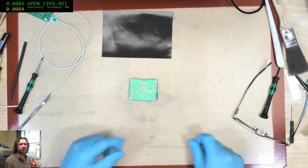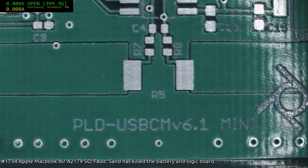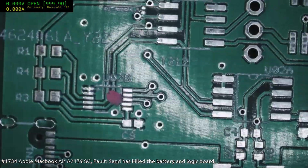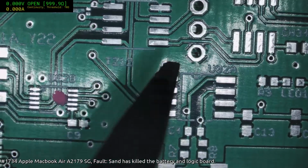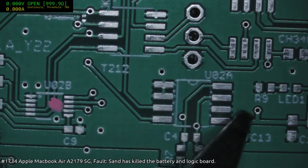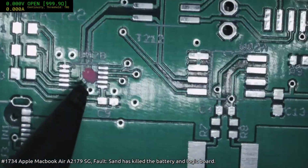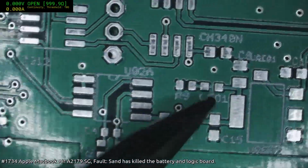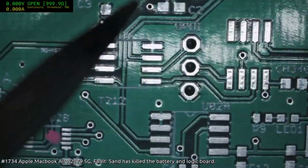Yeah, so these ones have the mistake on them with the I2C lines being swapped. Look at that, nice. So hence I've got the pink mark of death on it. And also, see, I've still got the INA 219 on it. But now that I have a good supply of 237s, I've eliminated that, moved that to there, swapped the lines so they actually are correct. But you can see it has the 340 footprint there and the 2 regulators. But yeah, so it's a bit unfortunate.